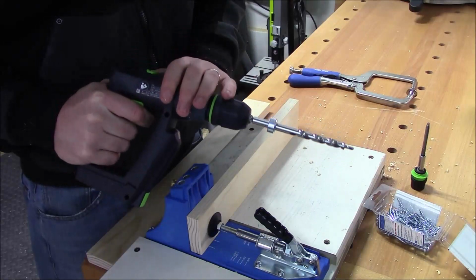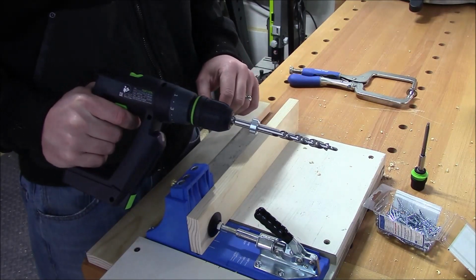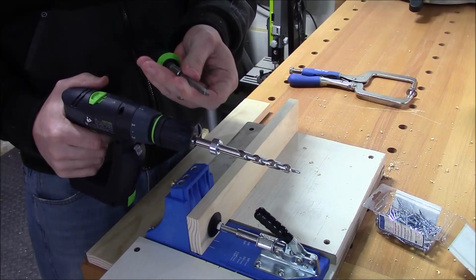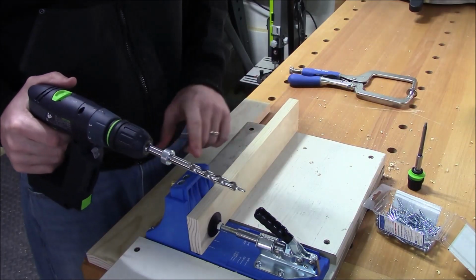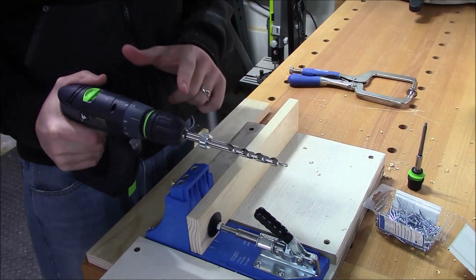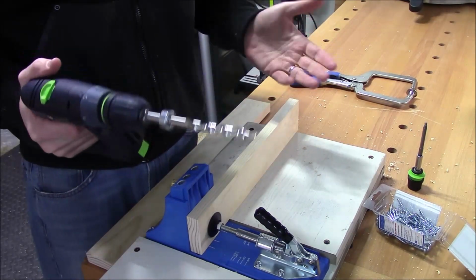If you plan to use the drill in a workshop environment, it can really speed things up because of those interchangeable chucks. Because in the keyless chuck, we can go ahead and keep a drill bit installed. And then in the bit holder, we can keep whatever bit we need for assembly. In this case, we're dealing with pocket holes. I'll go ahead and pop a couple holes in this board. We'll assemble it to the other one. And because we don't have to deal with multiple drills or remove the bit and install another one, it really makes the process only take a couple seconds.